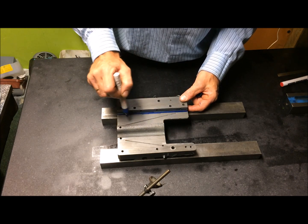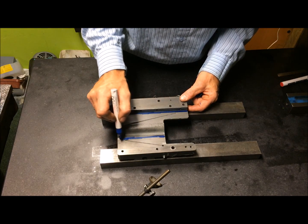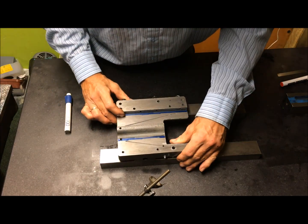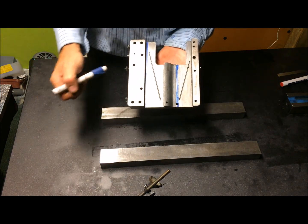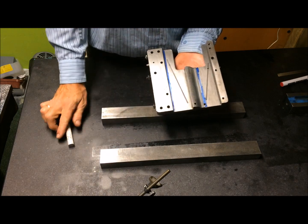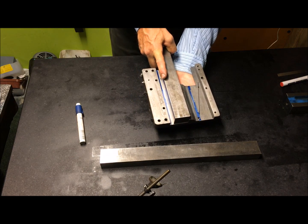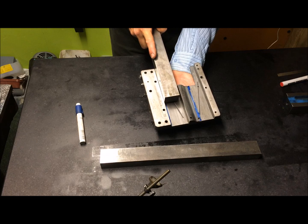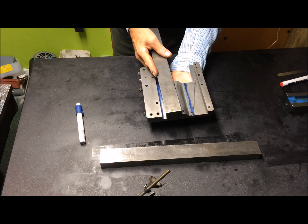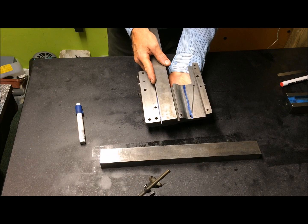I know that this surface, like here and there, up to where you see the line, that is the unworn area when it's riding on the narrow guide bed, towards that end. So it's just like this. It leaves this area over here, the blue dot now, pristine. Same goes for this one. And then this also comes into contact there with the gib, of course, so it's not that much, but anyway.